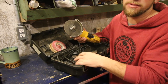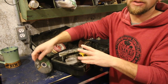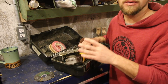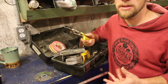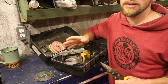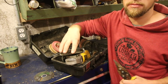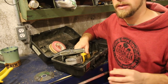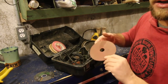Let's go through all the different uses for a grinder. Right now I have a thin cutoff wheel so you can cut metal. I've used this recently for cutting the duct work in the root cellar — it's amazing how fast and clean a cut you can make on a round piece of pipe. Your other option is tin snips, but if you've ever used tin snips, you know how much of a pain they are. You're bending the metal, trying to get it out of your way, and the cut doesn't come out straight. The grinder gives you a nice professional cut. Then when you're done cutting, if the edges are sharp, you can switch over to a sanding disc and sand the edges.